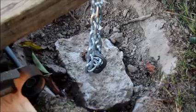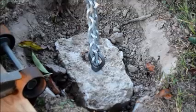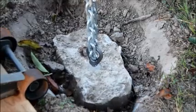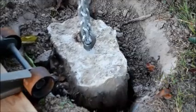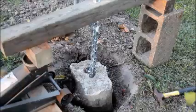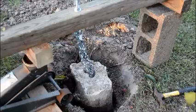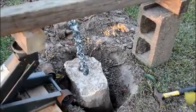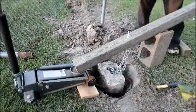The chain is attached to a 4x4 post with one end resting on a cinder block and the other end on an automotive floor jack. This makes easy work of loosening and lifting this behemoth block out of its unyielding tomb. Once I reached the limit of the floor jack and the block was loose, I needed to raise the yoke and adjust the leverage point in order to completely free the block from any stubborn, unyielding hold the crypt still possessed. Now it's time to remove the block.